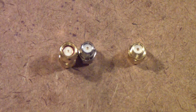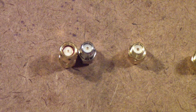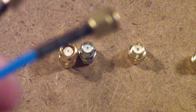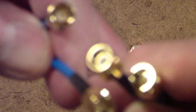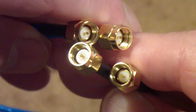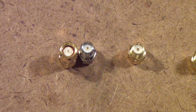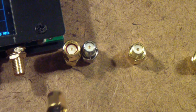It will only mate in reverse polarity. Let's take a look at some cables. With most VNAs that you buy today — the nanos and so on — you get a pair of cables that are male-to-male connectors. Notice that there are pins on both ends. Those work fine on the nanoVNA and will connect, for example, to this.